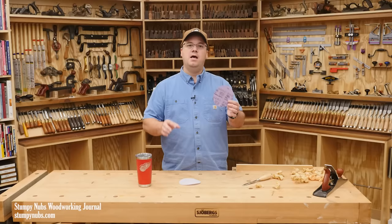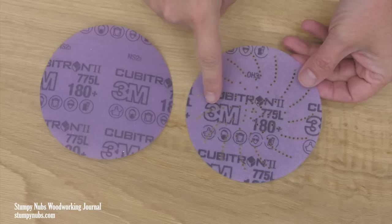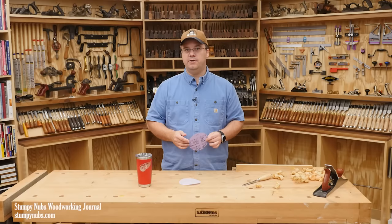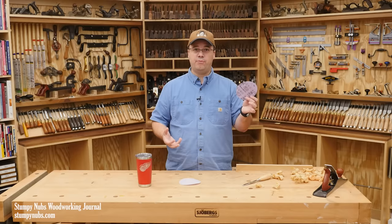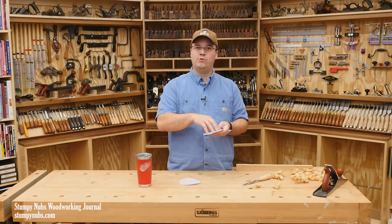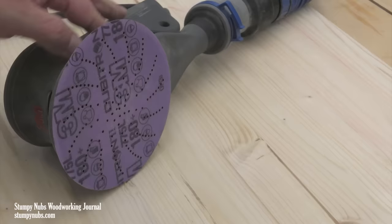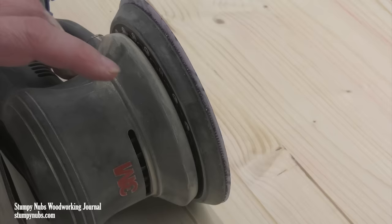Some are going to ask why my discs have a spiral of tiny holes instead of the more common five or eight large holes that line up with the ones on the bottom of your sander. When I started using these I noticed they seemed to suck up dust a little better, so I reached out to one of the engineers who developed them at 3M and asked why. It turns out that a specific pattern of tiny holes actually spreads out the suction coming from your five or eight larger holes at the base of the sander — like the difference between vacuuming with a wide foot attachment versus just using the end of the hose. The hook-and-loop material that holds the disc on leaves small spaces where dust can migrate between those tiny plastic hooks and into the sander's airstream.